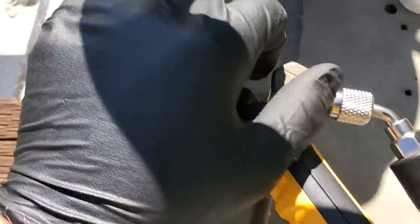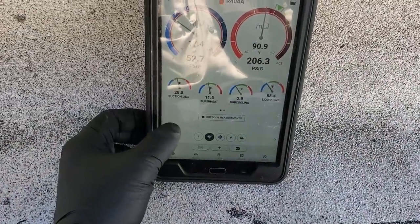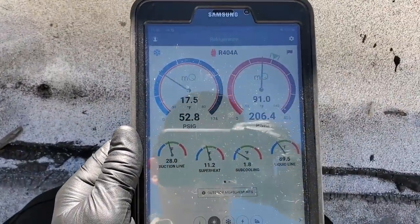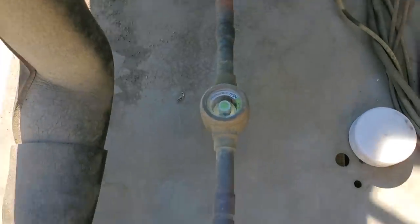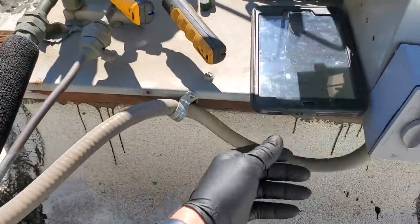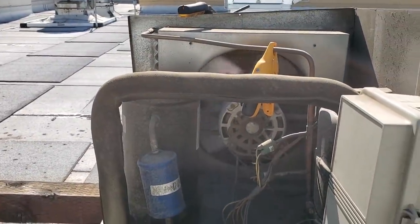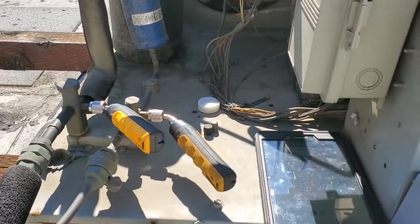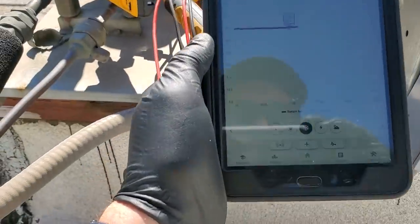The flashing sight glass again. Let's see what our superheat is at when it's flashing — our superheat is only 11 degrees when the sight glass is flashing. It's not like it's flooding, but then it clears up. I think we're going to leave it be — maybe the liquid is just building up in the condenser or something. This unit doesn't have a head pressure control valve at all; it's just fan cycling. And we shut off at 34 again.